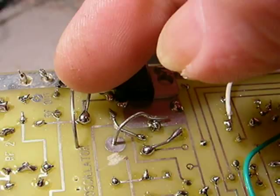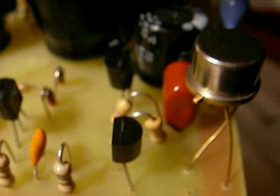Make sure it does not short on the ground and does not short on any other terminal. Now, take the 10-ohm resistor — the 1-watt 10-ohm resistor — and you're going to see there are two little holes left here on the board. Put the 10-ohm resistor down into those two little holes.